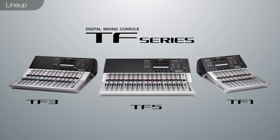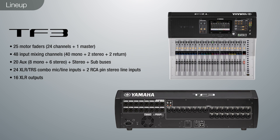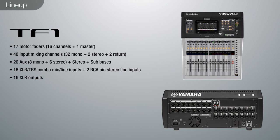Firstly, you can see there are three sizes of TF. The difference between them is basically the number of analog inputs and the number of faders. The TF5 is the largest, with 32 analog mic preamps, 40 mono input channels and 33 motorized faders. TF3 is in the middle with 24 mic preamps and 25 motorized faders, but also with 40 mono input channels. And TF1 is the smallest.